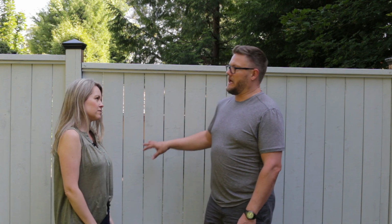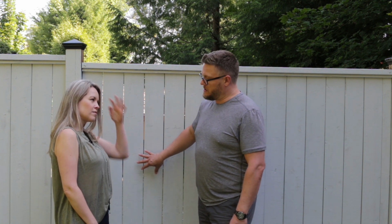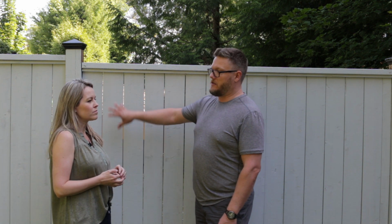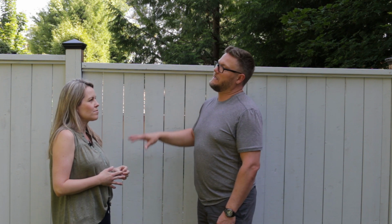It's an old fence, and we did not have, especially on this side, a lot of wood to repair or replace. If you were replacing wood, you definitely want to replace the pieces that are totally rotten, then use the stage 2 product, the treatment, because it will pull the tannins out. And if you do that, you technically shouldn't need to prime if you've got a good solid stain.